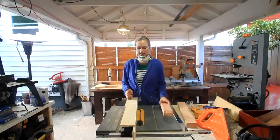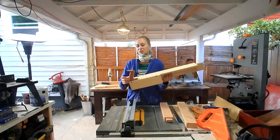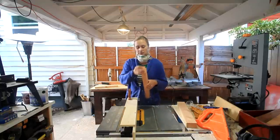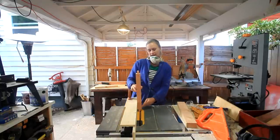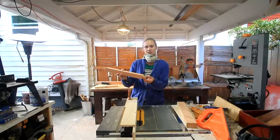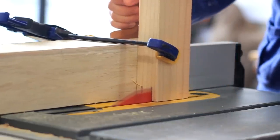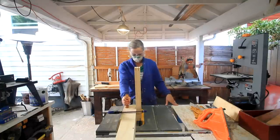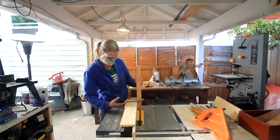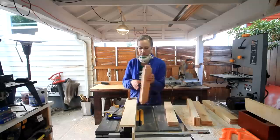To cut these tenons I made a jig out of half inch plywood — very simple. I used the old handle from my plane and it just fits over the fence. I am basically cutting a one inch tenon. I clamp the wood on and then I can easily move and cut off the three-eighths inch on both sides. Now to finish up the tenon I need to make this cut here, so I have one that is already done and I'm just going to use this as a guide.